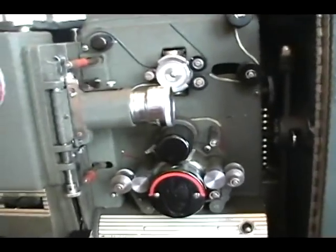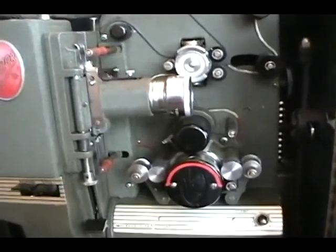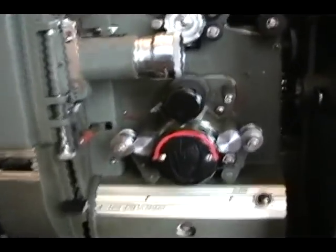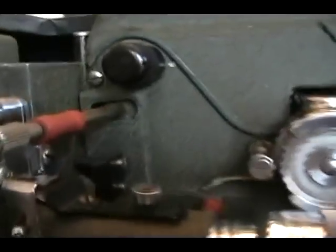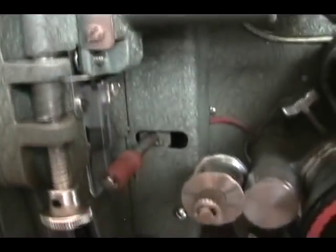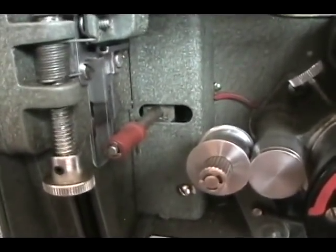What's compelling about this machine is that it has a fail-safe mechanism built in, with three film trips located within the film transport system. What that means is if the film loses its loop or something gets tangled up in the projector, the projector turns off automatically without further damage to the film.